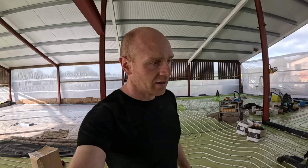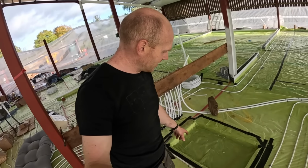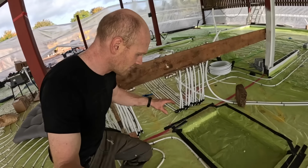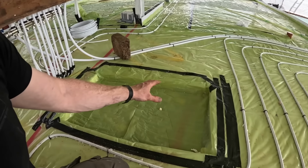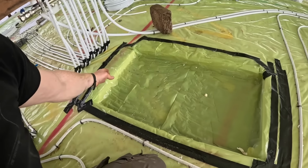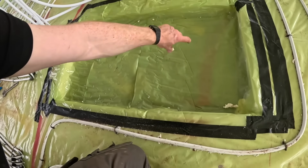And finally, for our most unconventional part of the build so far, well, certainly the oversite prep, is this. It's not a foot bath, it looks like the sort of thing you'd sanitize your feet in for biosecurity, or going into a swimming pool. It's not. Underneath here, we've actually cut out the insulation to reveal this meter by 600 void, which was the full depth of the insulation. And we decided to take all the thermos that were temporarily being used on the pool side. We've chipped them off because they come off quite easily, and we've put all 10 side by side in here. I don't know if I filmed it or not, but it's basically those 100 mil thermos in there.